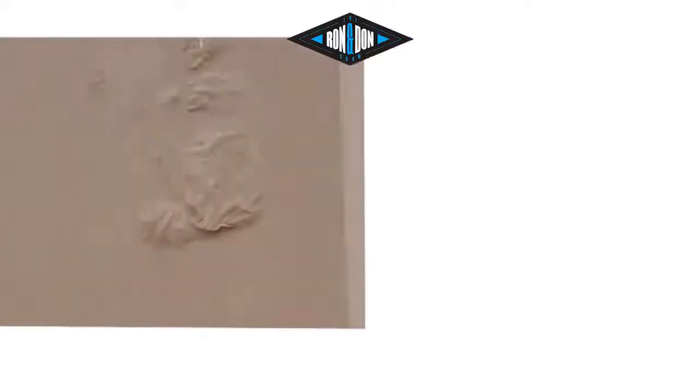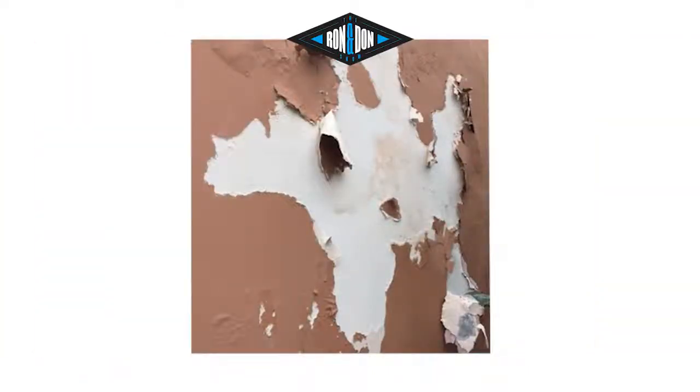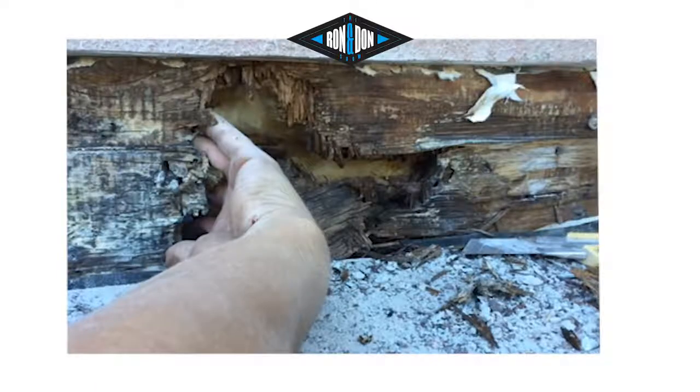I guess that leads right into me, and we had some real major problems in Maine and Maryland and in Austin, Texas, where the whole exterior surface looked like it had the scabies or chicken pox, and it was a mess. Exactly. And we were running into a lot of those same situations, particularly the ones in the northern climates. And while the solution sounds easy, it's actually a little labor intensive, because what you've got to do in that case is find all the delamination on the building, remove it, and then reinstall either a good primer over the top of it to prevent it, or in some cases, we had one or two of them I know where we actually had to take the entire system off the sections and reapply it again, which gets to be quite labor intensive. Well, and expensive. We had rotten plywood behind some of it. Yeah, because there was so much moisture involved.